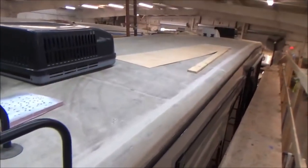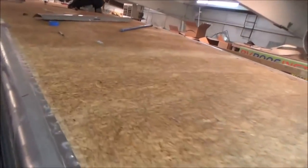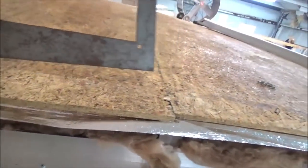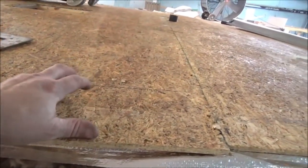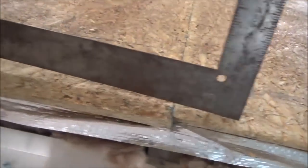We've got the roof stripped off, and now we're looking at the decking to make sure it's all set. But one of the things we noticed — look at that dip right there. That is a serious sag. Instead of roofing over it, we're going to pull this piece up and see if we can strengthen it. It's got a really bad dip on the shoulder — when it comes around the shoulder it rolls down then comes back up. The other side has a little bit but nothing like this — this is significant.